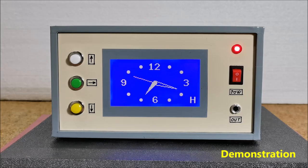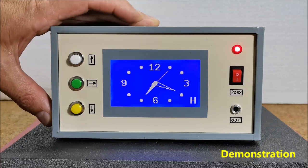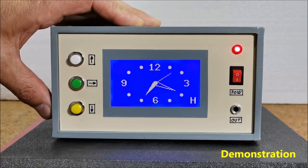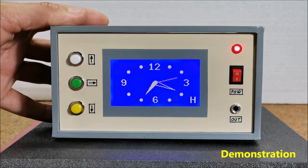When it comes to precision, considering that we do not use a real-time clock module, the clock is quite accurate. In my case, for 24 hours the difference between real time and that of the clock was only a few seconds. Finally, the device is built into a suitable box made of PVC material and coated with a self-adhesive colored wallpaper.